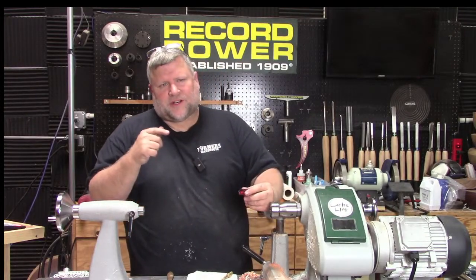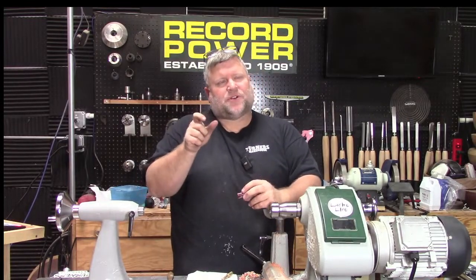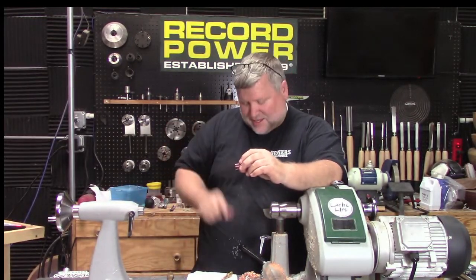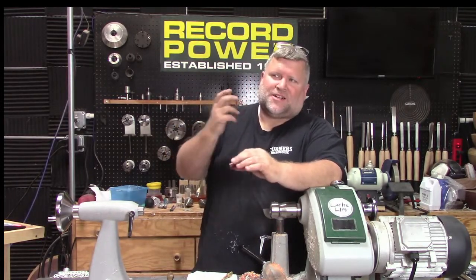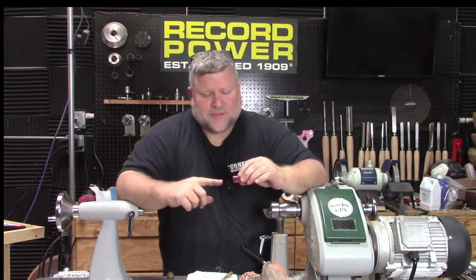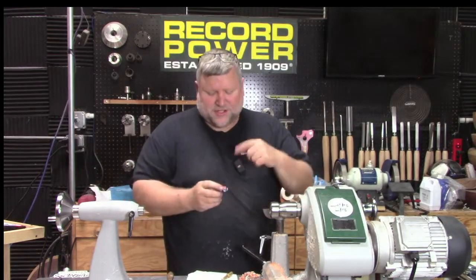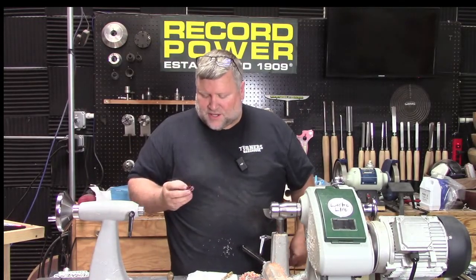If your nib threads in but then stops too high, you're probably short on your second bit, which is what the body, the outside of the housing, slides into. So you can kind of just think about what it's doing and what would cause that, and you can usually figure out your problem. Rarely do they go right the first time, but after you do a couple of them, you're like, okay, I kind of get what I'm looking at. You just have to think in reverse, because all those outside shapes are inside, and it works pretty good.